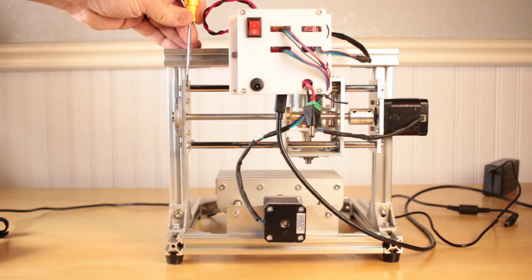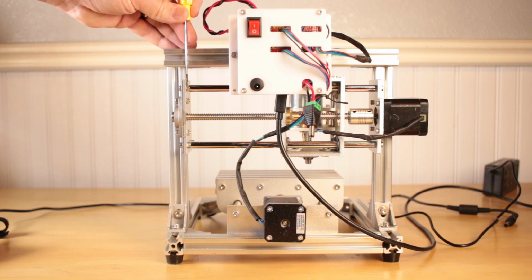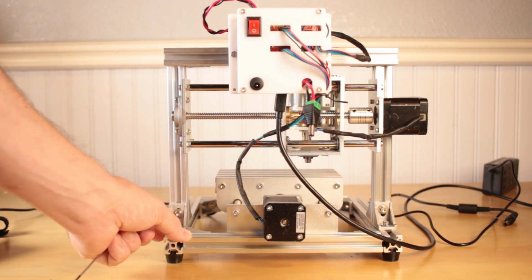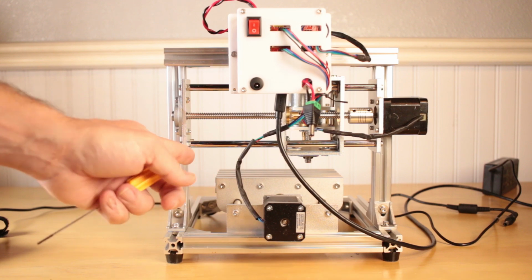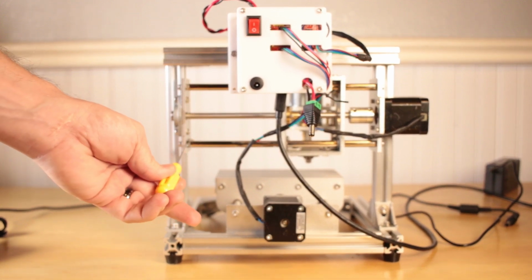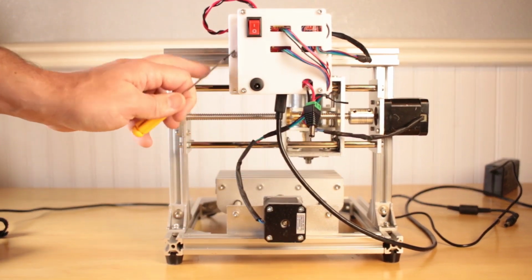An important detail to note is these two nuts, which I have used on the end of the linear bearing rods as spacers. Now the 2020 extrusions at the front and the back were not cut to the correct length, so those go inside the frame, which means that the frame is too wide for the linear rails. So I had to add the nuts, and they may not be exactly precise, but they do the job because this aluminum plate can flex a little bit to make up for any slight discrepancies between the lengths.